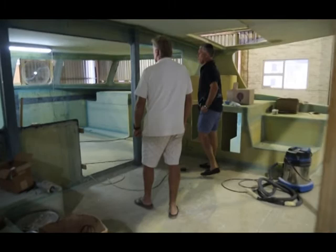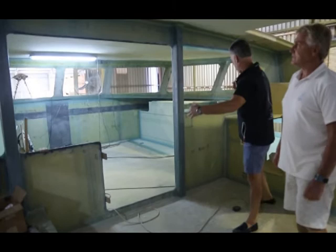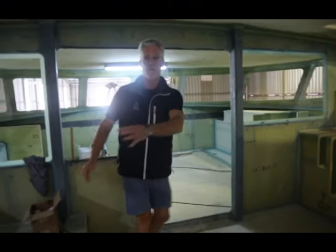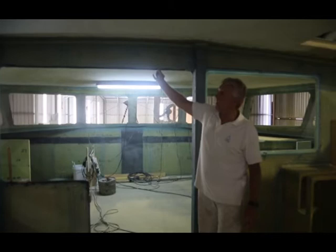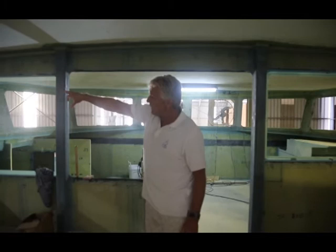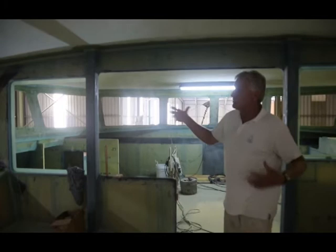When you come in here, you can see that one of the important things on the boat was that we wanted the space between the salon and the aft cockpit to be as open as possible, so that when you're sailing with the versa helm, you have a window that opens up here and a sliding door that doubles over so that these two spaces become one. To achieve that, it was really important that Jonathan could create the structural stability to support the weight of the top and the doors — stopping the boat from twisting and making it really strong. You'll see around the door there's a carbon fiber capping all the way around the frames. On any cutout in the boat there is carbon fiber, and on areas where it's quite narrow, we put a carbon band through there just so that you don't split the boat.